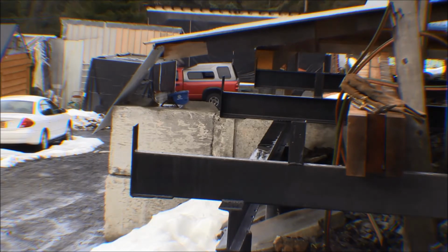Anyway, I've already got these beams cut and fitted in there for an 8-foot floor. I've been working on making extensions for them. I've got those all set up, welded up and ready to go, and I was hoping I could get that done today, but I probably can't. I've got these pads on the end, those L-shaped angle brackets I welded onto the end of the channel iron for the timbers to butt up against and be fastened down on. But they stick out on either side of the beam. They're wider than the 1.5 or 2 inches that the flanges on the channel iron are. And I want the new pieces to fit tight up against them and be welded in tight to them.